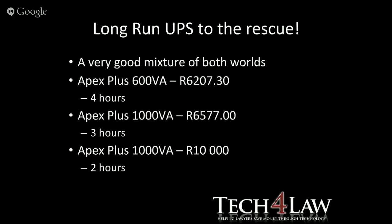And you see, with inverters, like I said, there is a changeover time. They call it the transfer time from AC to battery, and they were saying from 10 to 20 milliseconds. Now that's a little bit concerning, because if it's at 20, it means that the PC is going to switch off in between that dip. So if it's closer to 10, you won't notice anything. The PC will carry on throughout that dip. But as I said, if it's 20, there's a problem. So we might want to find some more information on that.